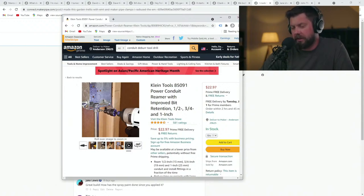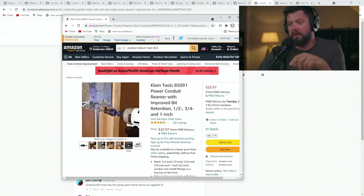Oh, D.H. Vargas, hey, D.H. Vargas, good to see you again. Thanks for tuning back in. He was with us last week. And he says to deburr the conduit, use the tubing cutter and don't cut all the way through. Just snap the conduit over your knee like you do a stick, and you won't have the internal burr to mess with. Yeah, that's a great tip.